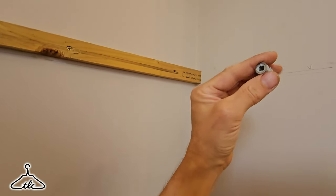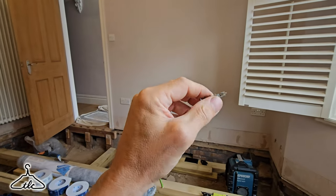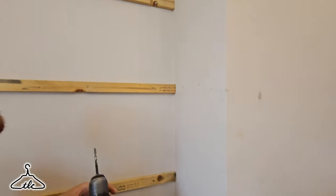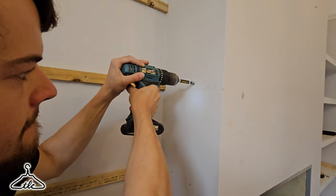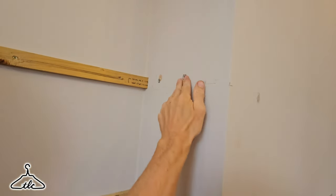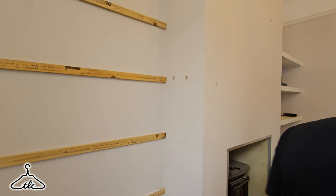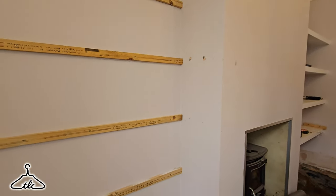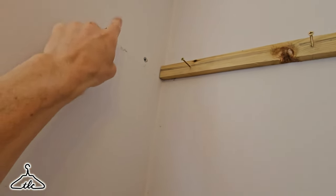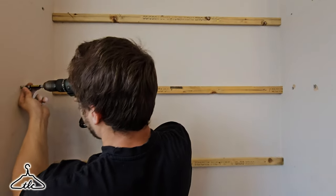Then the goods go in: just pump in a normal 50mm wood screw through the timber into the corkscrew — that's what they're designed for. Get the metal ones; I'll leave a link. We're using 50mm normal wood screws — about 20mm through the batten and about 30mm into the actual corkscrew because they're 30mm long. We'll carry on and do that and show you what they look like in a moment.